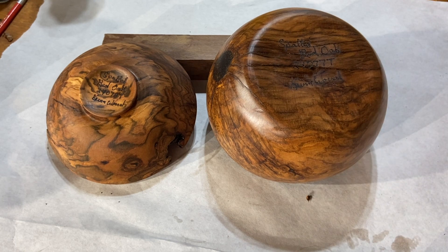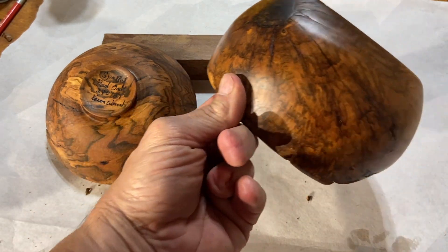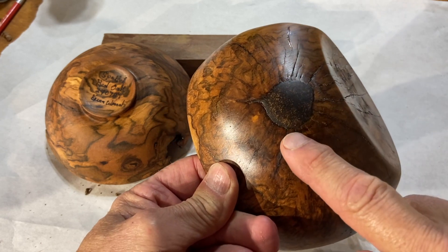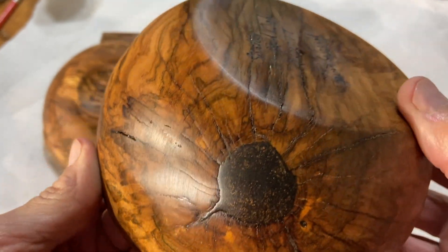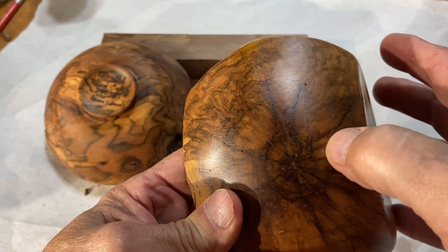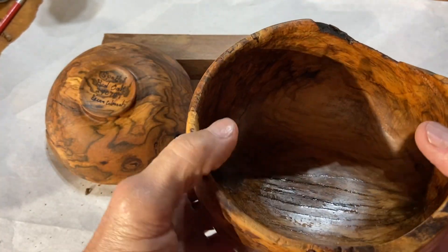One piece we didn't get — this one. I'm not even going to try to save it; it's just too much rot. But I ended up with these two bowls out of the rest of that piece, and this is all spalted red oak. Just look at the colors in that. This is epoxy filler — I used a mica powder, it's a brown with brass shavings in it. If you look real close you can see the brass shavings. Give it a little something. This one held. And this one we put brown CA glue in — filled some of the cracks. There's some on the backside too. But pretty, pretty, pretty bowl.